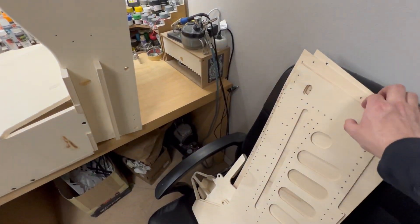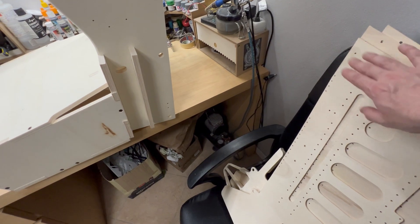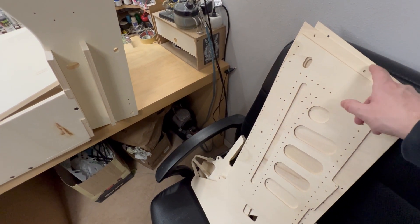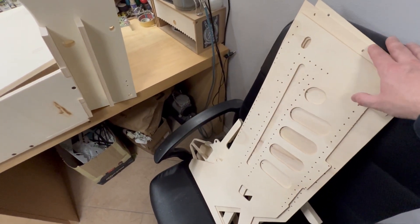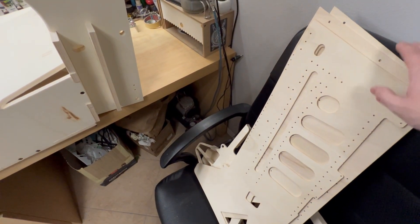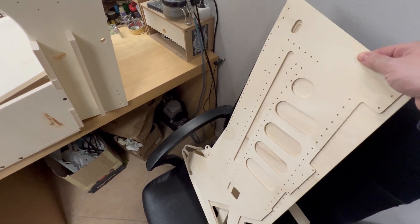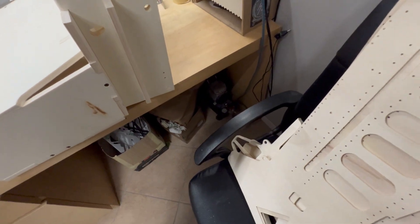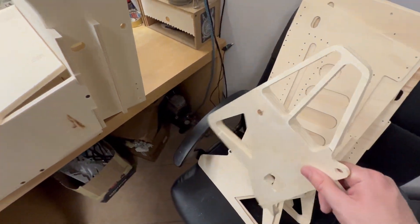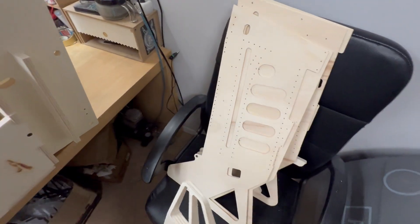Next step: the side skins. These are just three millimeter thick plywood and quite flexible. The plans actually call for these pieces to be cut from three millimeter aluminum sheets, but since this is a prototype I just wanted to make sure everything fits without problems. To add rigidity before installation, I'll glue two sheets together to make them six millimeters thick and sturdier. There's also this 18 millimeter thick piece that sits at the front to give even more strength to the whole thing.